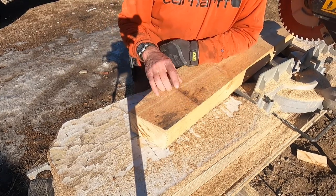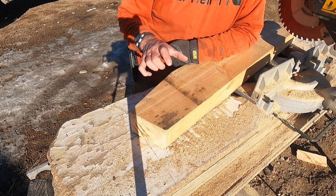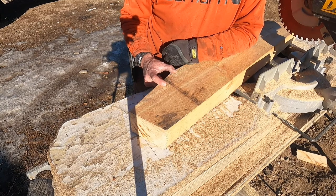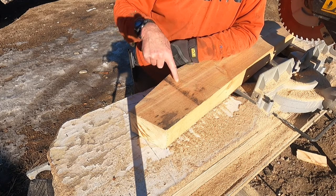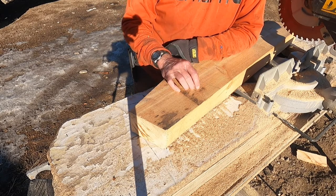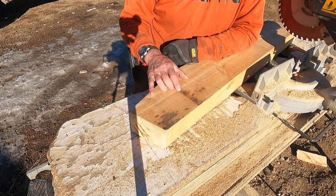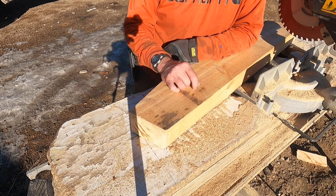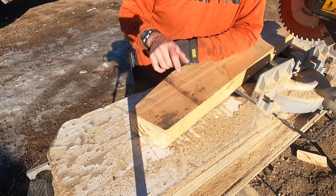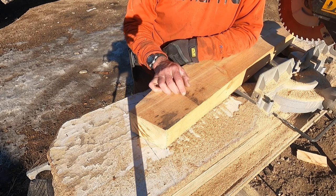That's one thing I forgot while I'm here at home before I go to the job. To just make it easier when I get there, I can just put stuff together. To attach these to the 4x4 post that goes down to the concrete, I'm going to take a 2x4 on both sides and screw it into the rafter here, and then screw it into the post. And we'll kind of put a 45 chamfer on the end of it, just to make it look nice. So I'm going to cut a bunch of those while I'm home, and then when I get there I can just put these up, put the 2x on them and screw them together, and probably use some PL 400 or subfloor adhesive of some kind. I don't know what they have anymore, but that's what I used to use, and glue them to the post and the rafter, and they'll never come loose. So yeah, let me grab a 2x4 and I'll show you how we're doing that.